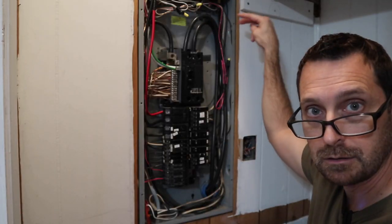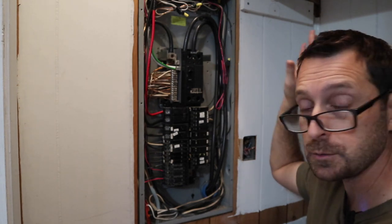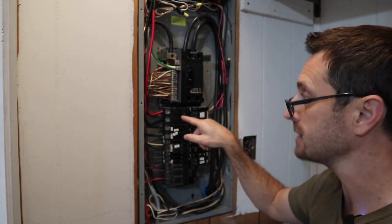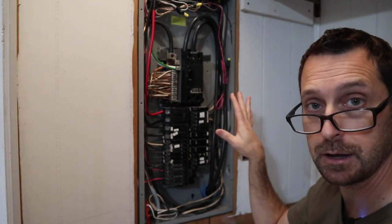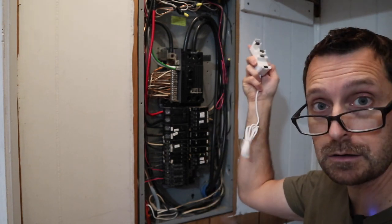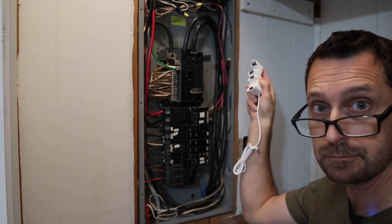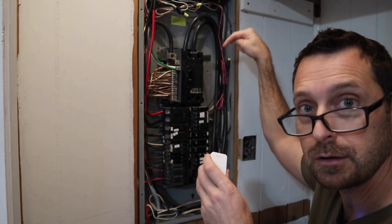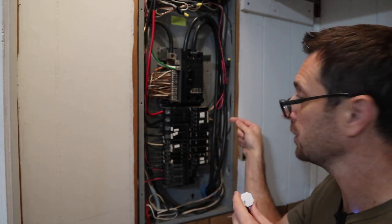These are the two main conductors coming in and supplying our house with 200-amp service from the grid, which we are still attached to. Over here is our solar breaker — a 70-amp breaker that feeds in from our off-grid system, working like a generator. I'm going to connect these big 200-amp sensors to the two main conductors coming in from the grid. It doesn't matter which sensor goes on which conductor, but conveniently these sensors are marked with an arrow toward the breaker — and the small sensors are labeled the same way, with the arrow pointing toward the breaker.